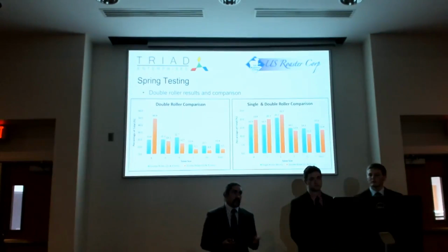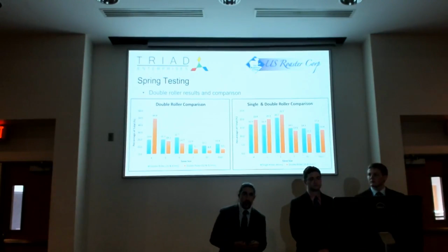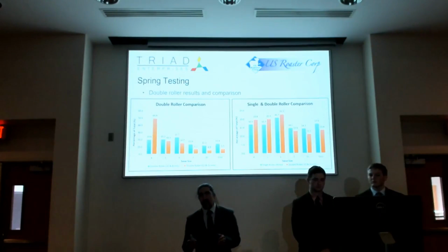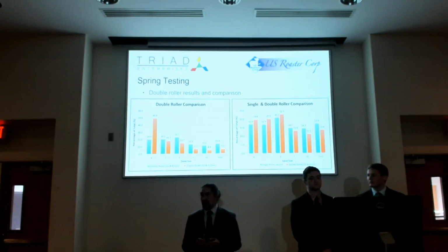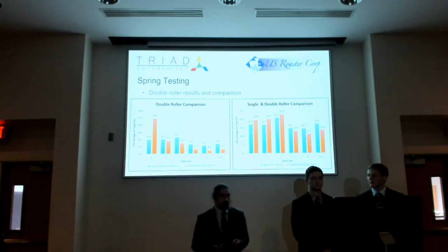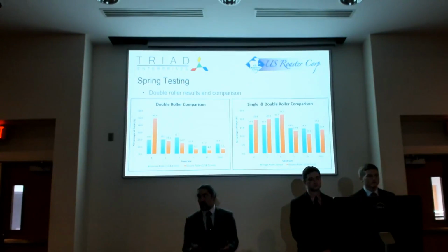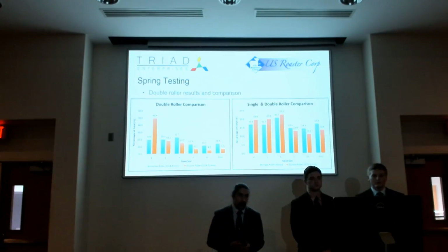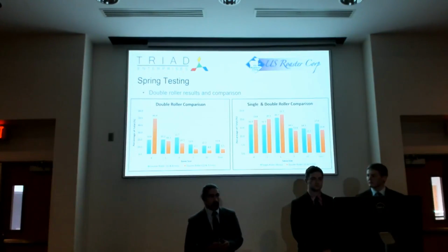Further testing, we tested a double pass. So on the graph to our left, we have a double pass at 12mm and then the second pass at 10mm. And we compared that with a 10mm and an 8mm double pass. And the idea of doing the double pass at such wide gaps was that the beans may have been compromised on the first pass, and through the second pass they would have actually been cracked and would have been able to winnow. And also with 2 passes we were hoping to mitigate some of the dust waste production.